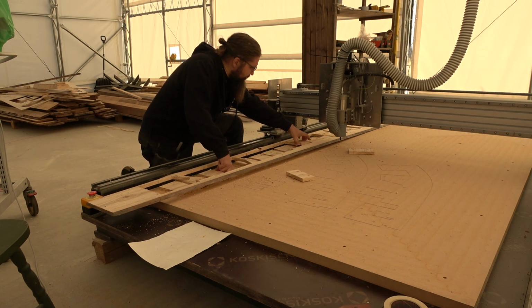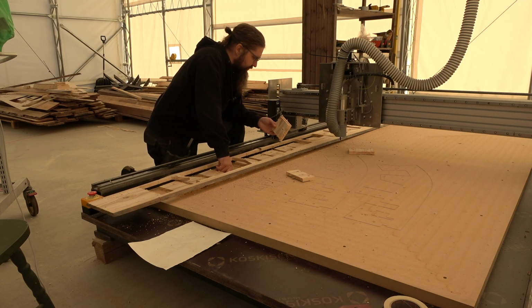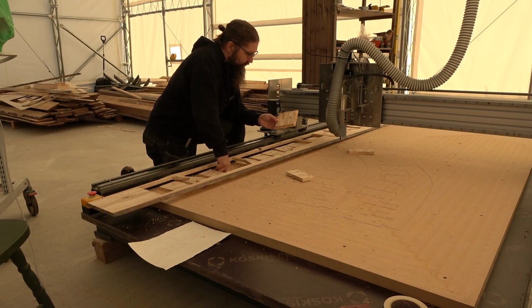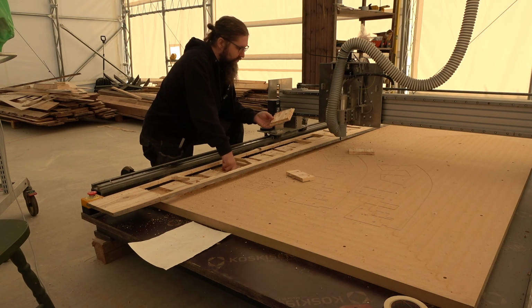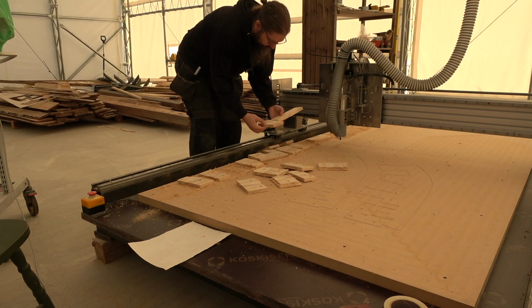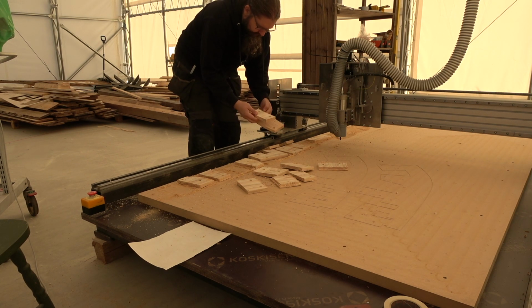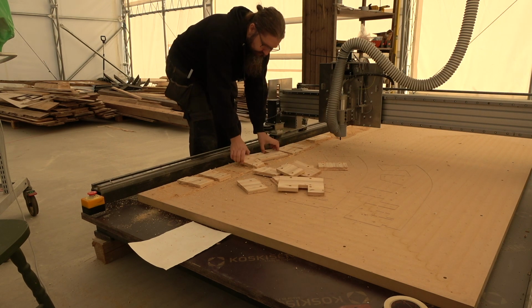One bigger issue was that for some reason the Fusion 360 tends to kind of flip the cutting edge in a way or another, so you have to be really careful which side from the line the machine will cut. And I think the router bit is a bit dull already. That has been used for some time. The edges in the end grain are not that perfect. Some cleanup to do with these.